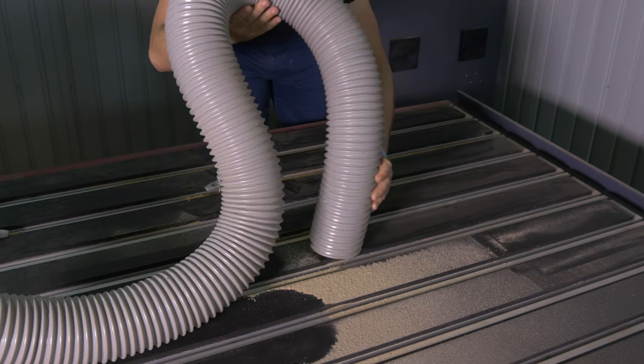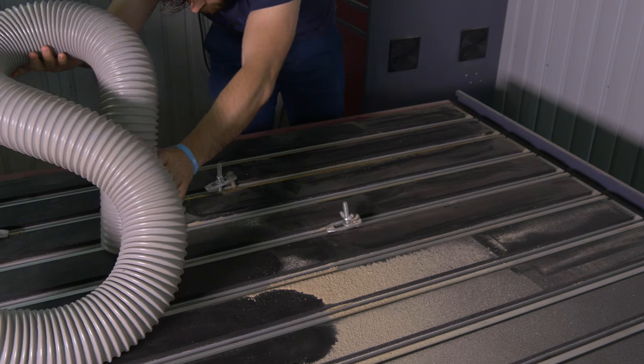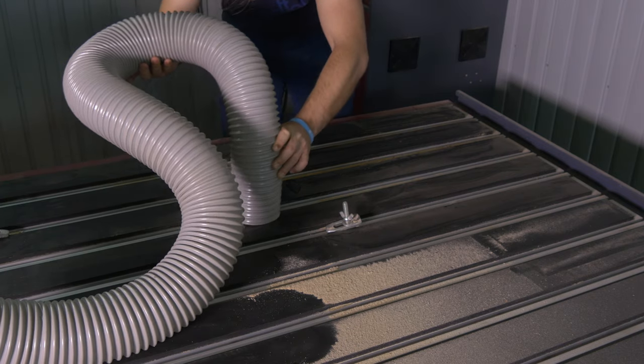Another difference in equipment is the way dust collection is done. There are a lot of great systems for collecting sawdust when you're woodworking, but you wouldn't want to use these for metal sparks, as they typically aren't designed to handle red hot sparks flying into them, and you could cause a fire inside the machine.